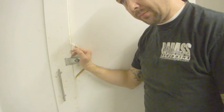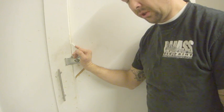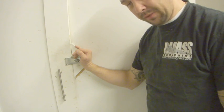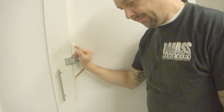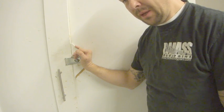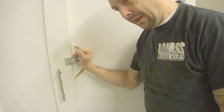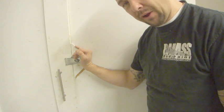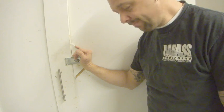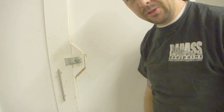I usually bake around 130 to 135 degrees, which is on the low end, but it prevents steam leaks. If you bake too high, you run the risk of steam leaks, and then it's a waste of your time. But if you do bake it high, you can bake it for just 2 or 3 hours, but the lower you bake it, the longer you have to bake it for. So I normally do about 135 for about 6 to 7 hours. And I guess we'll come back when they're all baked, and I'll show you how to demold.